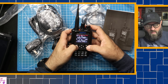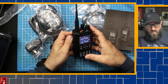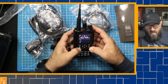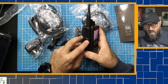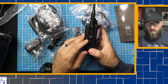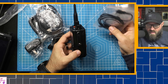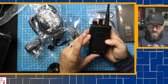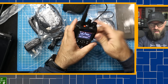P1 is the main button, P2 changes between channel and frequency mode. It's on AM 120.275. It's not allowing you to key up there - good, it really shouldn't. The OK button is the menu, and the home button takes you back out. The top side button below the PTT turns on FM broadcast receive, the next button turns on scanning. It has a dust cover on the other side with a Kenwood-style connector behind it, and USB-C charging right on the battery.